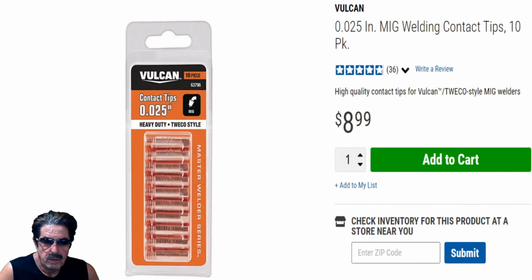Okay, so let's conclude the video on MIG welding tips. You're going to save money by getting them at Harbor Freight, whether you get the Chicago Electric ones or these from Vulcan. Just realize the size difference: you've got the 025, 030, 035. Sometimes they're out of stock, as people tell me in the comments, so just keep your eye out for what you need. I think the Vulcan tips are very nice tips. They're the ones that I buy. Other people at the club buy the Chicago Electric ones. Either way, you'll save money by buying the tips, and actually, these are a better deal than what you're going to get off Amazon.